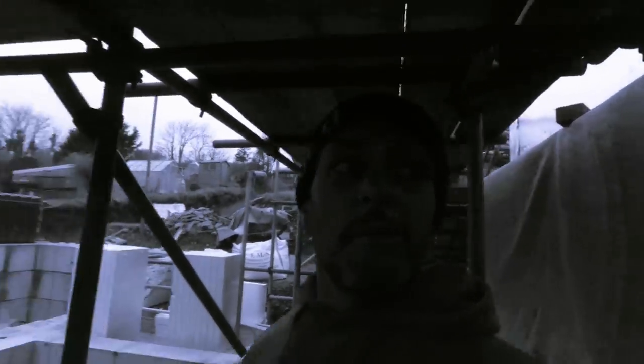There we go, we're getting a chunk on now. Big load of blockwork up. We've covered it in Hessian tonight, ladies and gentlemen, because it's very cold at the moment — we don't want the frost to get into our mortar. So we've covered it up in Hessian to prevent that. Any frost that comes tonight will land on the Hessian and not on the wall. Plus with a lot of scaffolding up, a lot of it will hit that first. But just to be safe, Hessian's right through.